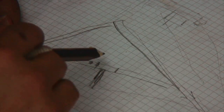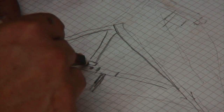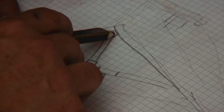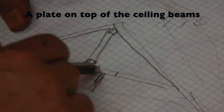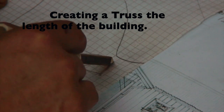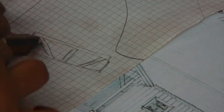So I'm going to have a piece, the middle of the building isn't exactly, and that supporting dividing wall between the garage and the carport, that wall isn't exactly in the middle of the building. But I want to have up here a construction with a beam that runs the length of the building. That's called a munsås in Norwegian. And then another one that sits on top of those beams, undergutted. And then from the side, it would look something like this. So there'll be a couple of svakter, as they're called in Norwegian, skråsvakter, wind braces to triangulate this box.